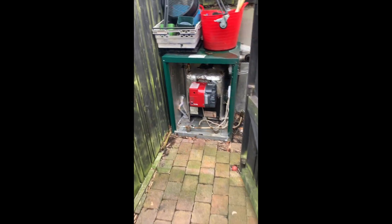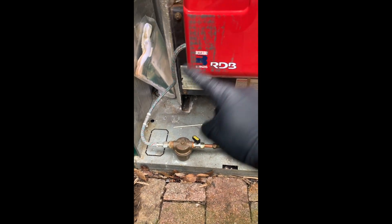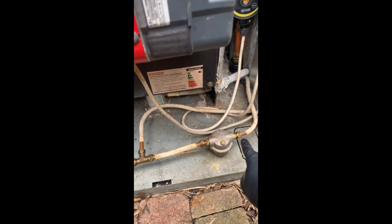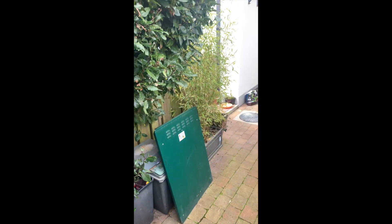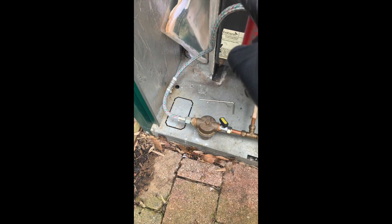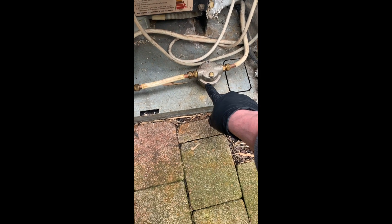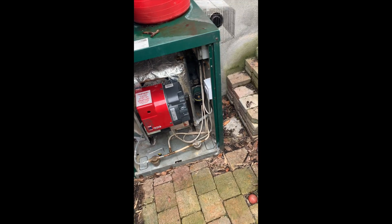That's it locked — I keep it unlocked. Then pull this lift, pull this back, and just set this over here to reveal the boiler. There's one filter here and one filter here — that's for the boiler. That's the T-junction there that splits it, and this one goes inside the property to a stove. The stove in there is not getting enough oil because this is suction fed and that is gravity fed. I feel that this filter, being in 10 years, is clogged. So the next step is to drain whatever's left in the lines.